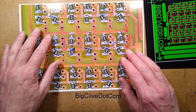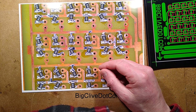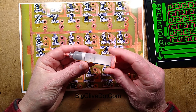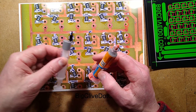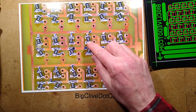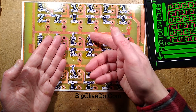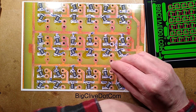The project was a test of reflowing with solder paste. The first thing I came across was that I'd had this tube of solder paste knocking about for a while. I didn't know you were supposed to keep it chilled to stop the solvent evaporating. But the nozzle was blocked, and I squirted some out into a new syringe and tried the nozzles - it takes an awful lot of force to get this paste out through the nozzles. After a lot of trial and error, trying the toothpick technique, the paste just does not stick to the copper. I thought it would be quite gooey and you could just spread it on, but it doesn't - it just lifts straight off.